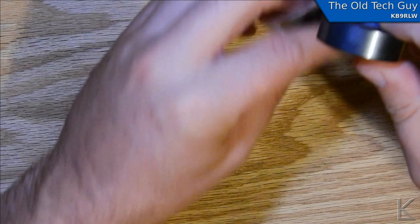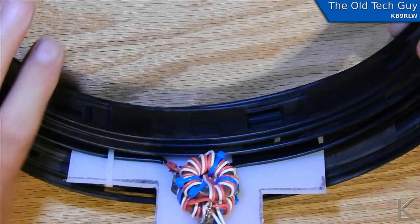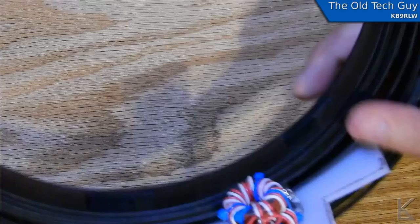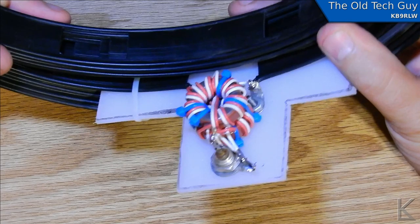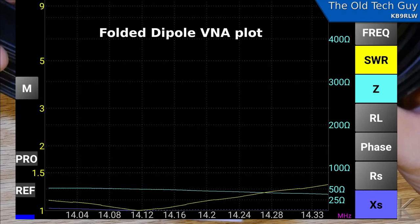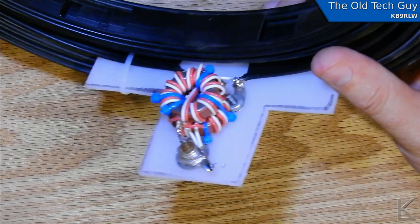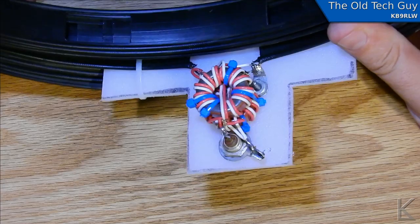I think it's a tighter packed core — almost solid — which probably creates a more uniform magnetic field than the lighter powdered core types. The folded dipole I made for 20 meters is here, along with the 4:1 balun I wound using the type 2 cores I had on hand. I swept it with the VNA and got pretty close to 50 ohms across the entire band, though the antenna's performance wasn't quite as good as a standard half-wave dipole fed directly at the center.